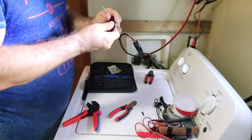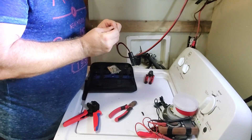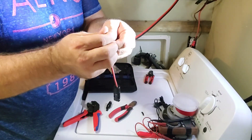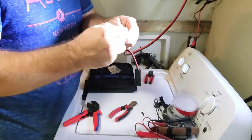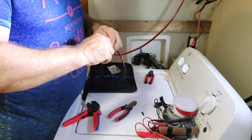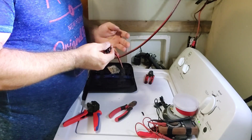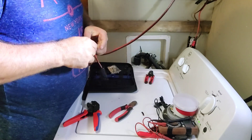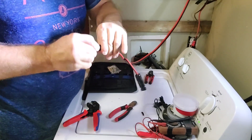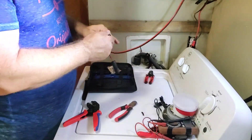What I'm doing here is putting a female interior and crimping it on. I like to hit mine multiple times — you don't have to — but I make sure it's crimped on nice and solid. That's 10 gauge wire. Then you put the back nut on first, and inside there's a moisture-resistant rubber or nylon ring that just pushes on. Then you put your moisture ring on, and then your actual male end. When doing a male end, use a female interior, and opposite on a female end. Push it in until it snaps, push the rubber moisture piece in, then put your cap on the back.